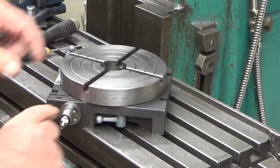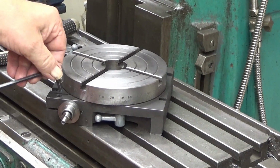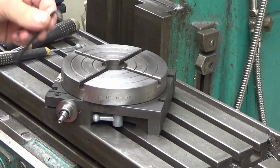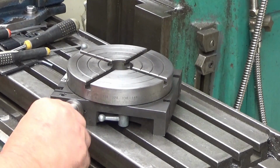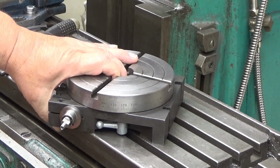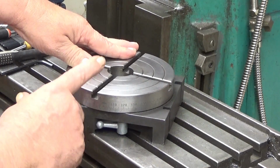There is a worm gear inside, which engages when you rotate it in that direction, and then you can lock it. And now this locks really easily, just by one finger like that, and no more force needed. Now it's completely locked. And now you can turn this. Well, this is quite near the traditional dividing head system, so the gear ratio is 40 turns of this makes this turn once.